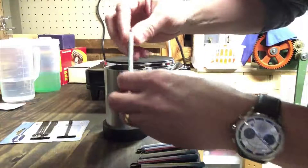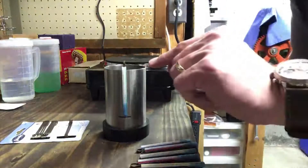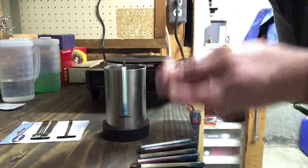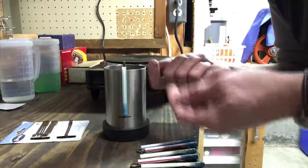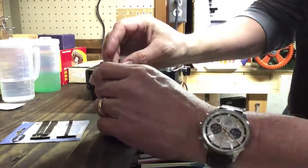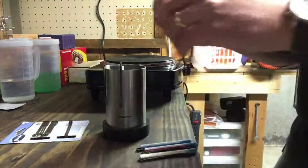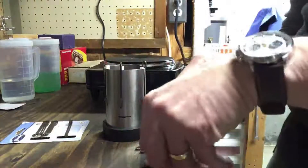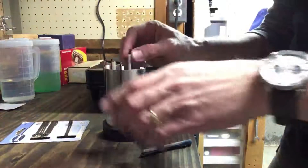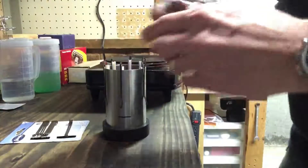On the inside I'll hold these about that high. I always want to make sure that the straw is a little bit higher than the top of the flask, because if it's lower, when that investment is bubbling it'll actually fill that hole. So you've got to make sure it's a little bit higher than the lip of the flask. Depending on what you're casting, I usually put between four and six straws in my flask, and I arrange them according to how the piece inside is sticking out.